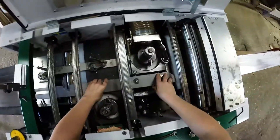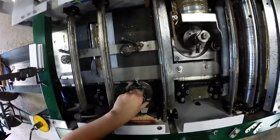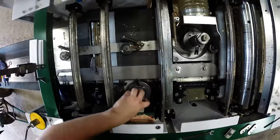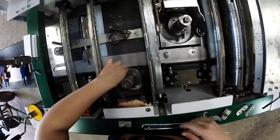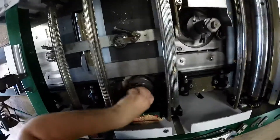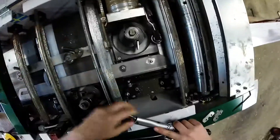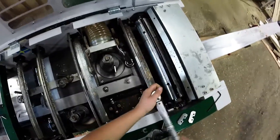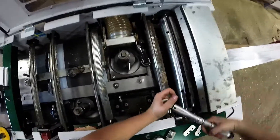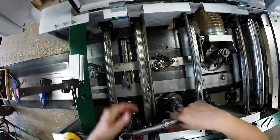We need a good stable reference point, so now we will set the fence. This tool is also sold by Logosol and it allows you to offset the first fence by 2mm compared to the second fence, so your side cuts are taking off 2mm when you're feeding the wood in. You can get these made to take off 3 or 4mm, but I wouldn't recommend going any higher than that. This tool was originally made from aluminium — I had mine made from steel because the blades were chipping the aluminium and the distance wasn't as precise as I would like.